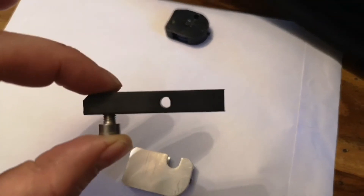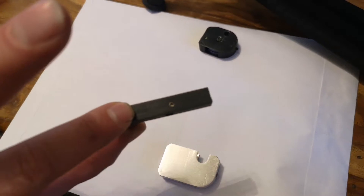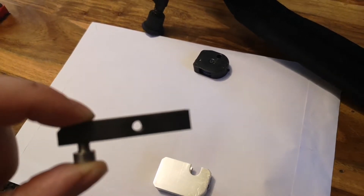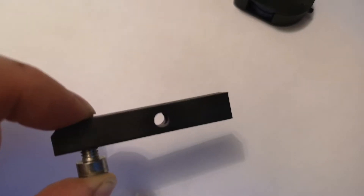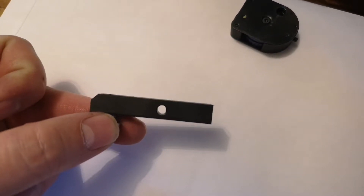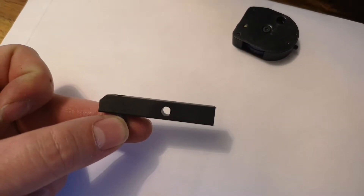It consists of two pieces. One piece is a Delrin block, 10 by 10. Inside that little M3 grub screw is — inside there is a little bit of O-ring, about 6mm worth of O-ring, protruding half a mil into the 5mm hole. Obviously this is to hold the pellet ready for priming it into the chamber. I tried going to 4.6mm but the 4.6mm drill wouldn't allow the pellet probe to pass through cleanly and easily.